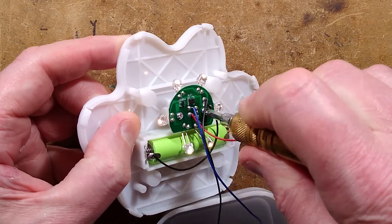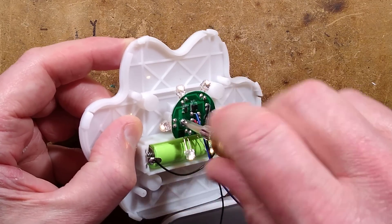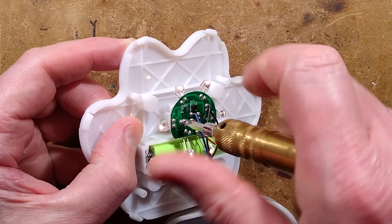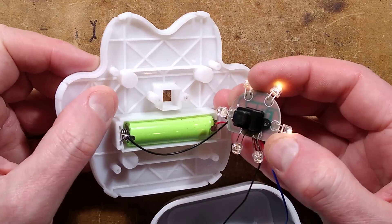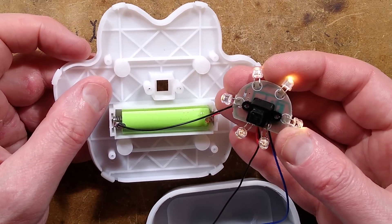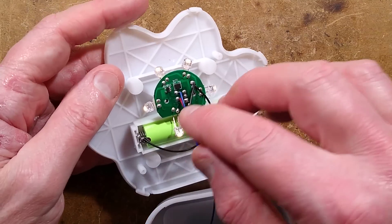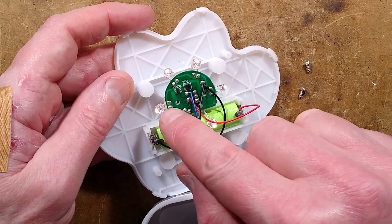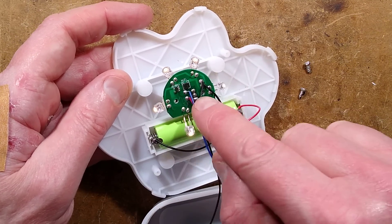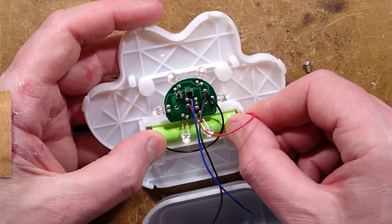Let's pop this out and we'll see if it is single-sided — I think it is. It is, with the rubber cap switch in the back. One good improvement for this would be the usual thing of pouring a bit of nail varnish or other lacquer across this to try and seal it away from water ingress.